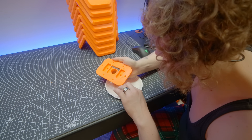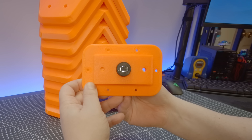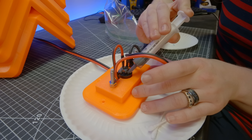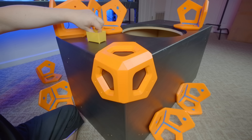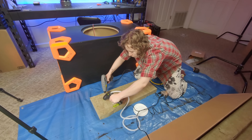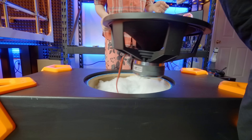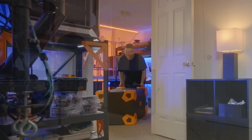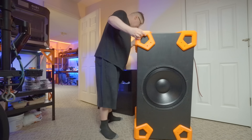The terminal plate will accept a pair of binding posts as well as the Speakon socket, which I'm welding into place. Oddly enough, the thing was manufactured with air leaks, so once the binding posts go in and everything's wired up, another glob of JB Weld seals the back of the socket. This just leaves the corners — each heavily dampened with blue tack — the terminal plate, and a bunch of rock wool acoustic insulation, with Sophie demonstrating the both-guns-blazing technique. Finally, after another 10 pounds of fiber fill, the 18-inch driver drops in flush, completing the build. The hand grips on the new enclosure make for some effortless maneuvering, even with it weighing in at nearly 200 pounds.